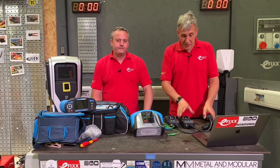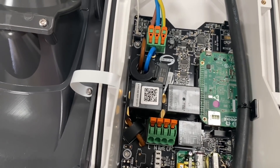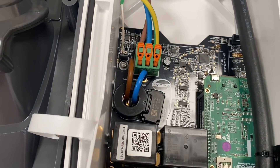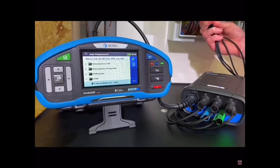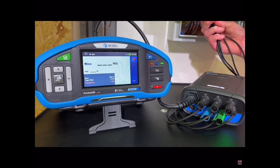Metrel are keeping up to date with market changes. We've now stepped up from the 3152 to the 3155, which guides you through the whole test procedure but also allows you to make your own changes. A lot of EV chargers now have all RCD functions built in, but some we're seeing only include the DC leakage part and rely on an external RCD. You may want to configure a dedicated test sequence for the specific charger you're installing — we've done that before, reconfiguring the insulation resistance tests for a three-phase installation.